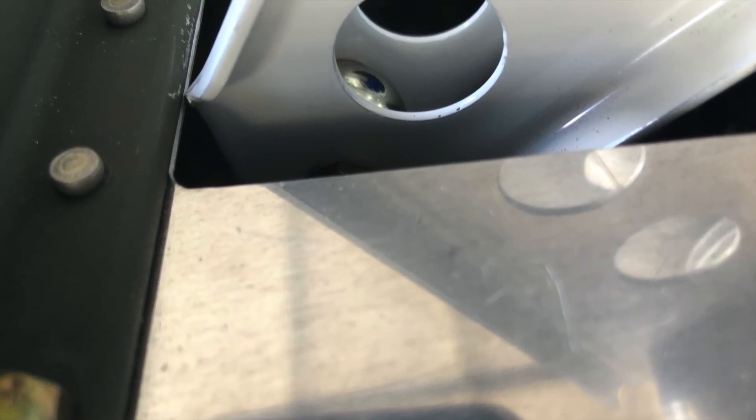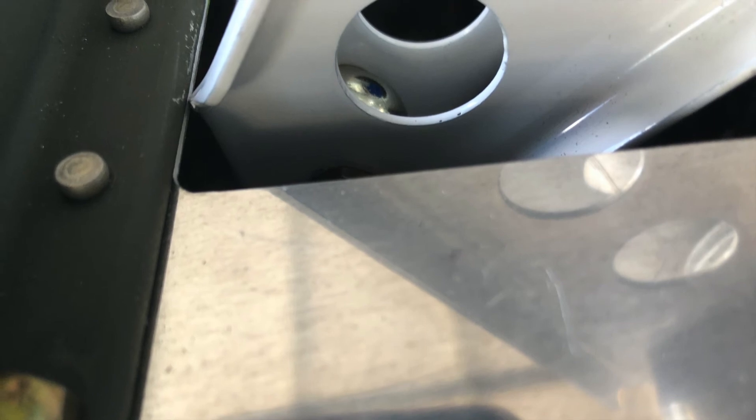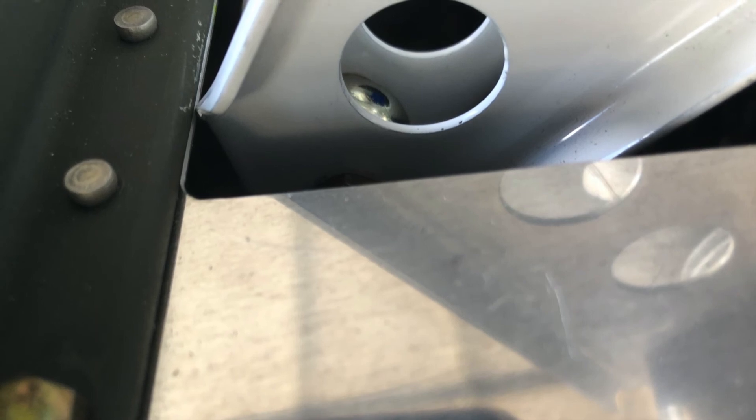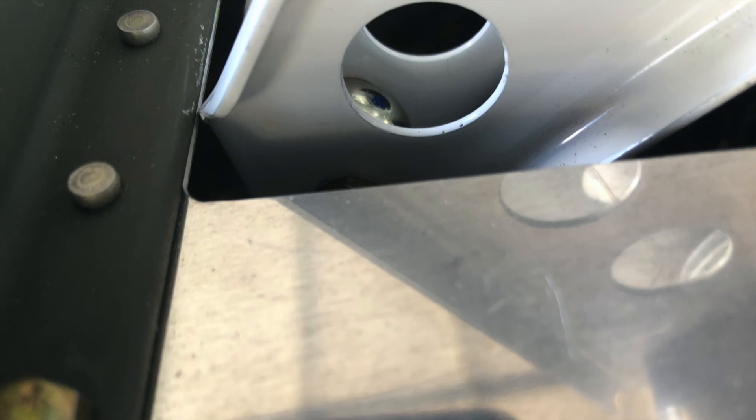There is supposed to be a fix for this. He described it to me a little bit — I didn't worry about the details too much because he said it's something we'll fix later. You'd either add some bar stock or some aluminum stock, or some washers, to lift the elevator stop a little higher. I'm not going to deal with it until I get to the point of permanently mounting, but it's noted in my instructions that this needs to be addressed. If any of you have run into this problem and know exactly what the fix is, or can send me some pictures or point me to your blog on how you fixed it, I'd greatly appreciate that.